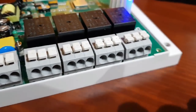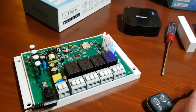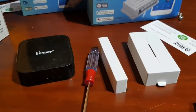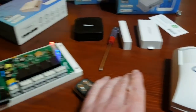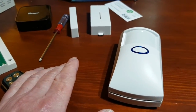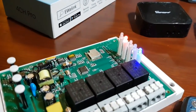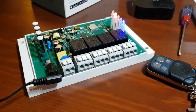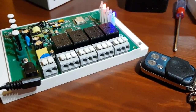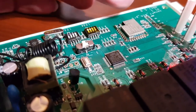You can also use the normally open and normally closed contacts to go from off to on or from made to open. Going back: channel 1 was on from the door switch alarm, and now the IR alarm triggers — channel 2 alarms out, knocking out channel 1. The functionality is just fantastic — we've got interlock mode, latching mode, and self-locking mode.